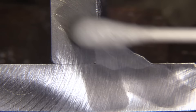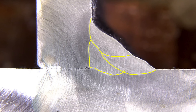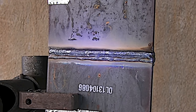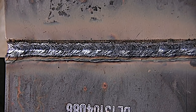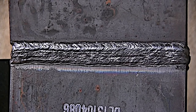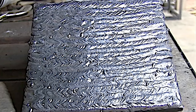I like to do cut and etch tests to verify penetration — your school may not have the capability, but it is a great learning tool. Eventually you'll probably do a 2G plate — G stands for groove weld. A 2G plate might be given for a structural welding certification, and it involves stacking beads, so the skill set is the same as padding beads. Don't shortcut that padding bead exercise because that's where you learn the stacking skill, and you'll get much more practice padding beads than running joints.